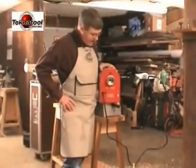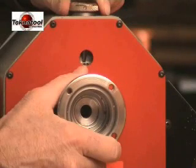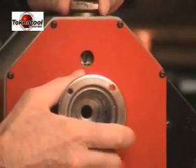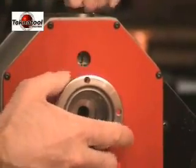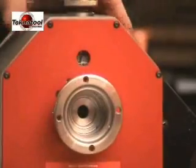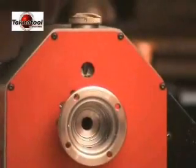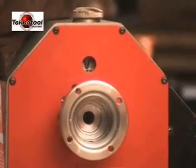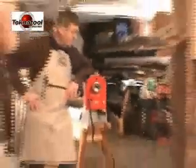The DVR has always had great indexing features, and it's even improved on the XP. We have a larger window here where we can see the numbers of the index scale come up. With this pin, we can index in 24 positions. We can lock the pin up when it's not in use, which would be for normal turning. 24 is a nice number for indexing that is divisible by 2, 4, 6, 8, 12, and so on, so it becomes very handy, very easy to use, very sure.